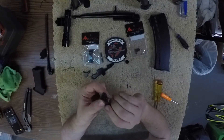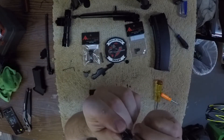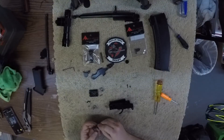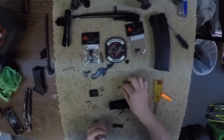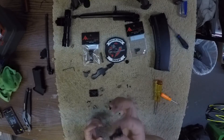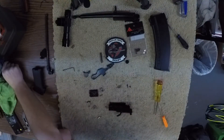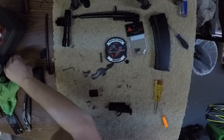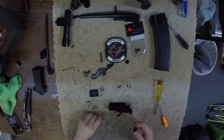Now we have these parts out. You can see how the spring works for the hammer — the long part goes in the back like so, and the shorter part is the one that gives it the tension. The only thing we're going to reuse from here is the actual spring, since RATech gives you a new roller. Take this hammer and throw it in the trash. Here you have a nice steel hammer — very very nice, probably shouldn't have any issues with this. Take the new roller they gave you and fit that into the hammer.